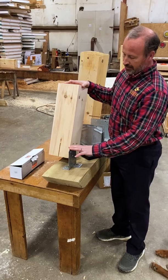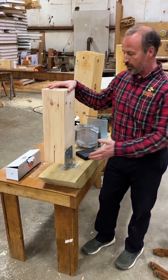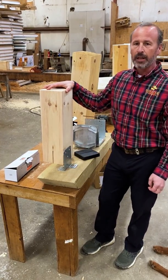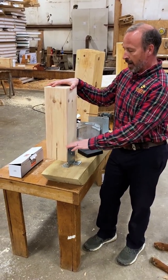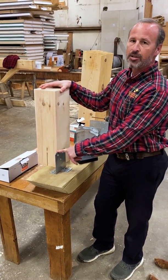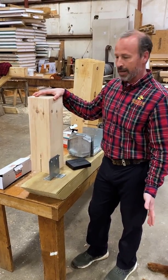The capacities for this particular base vary depending on the size you're using. These are made for 4x4, 6x6, and 8x8. The upper range of the hold down is around 3,600 pounds, and the upper range of the vertical load carrying capacity is around 36,000 pounds.